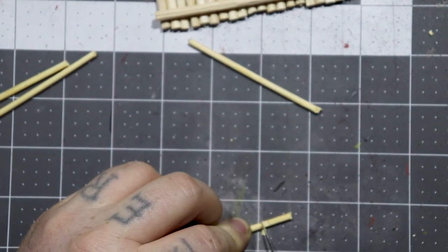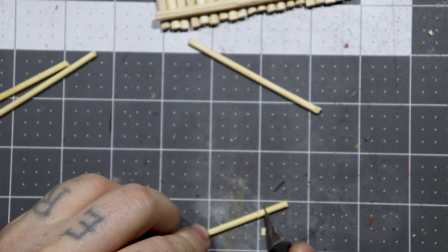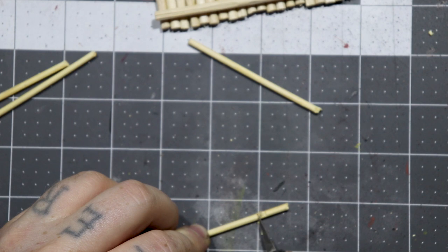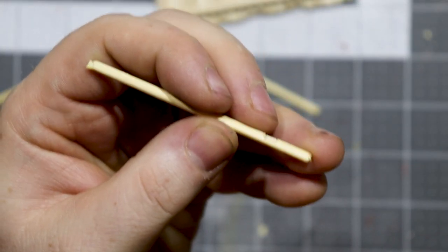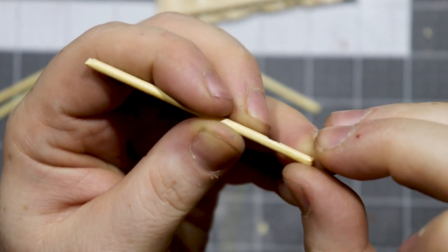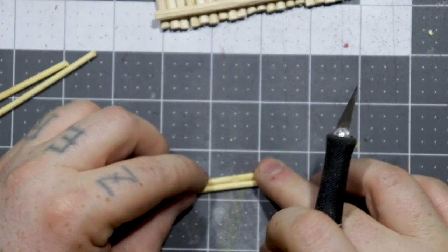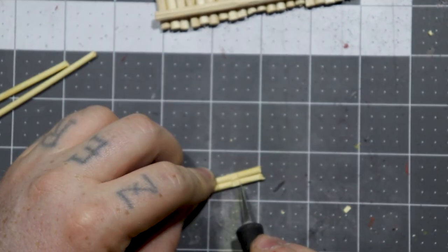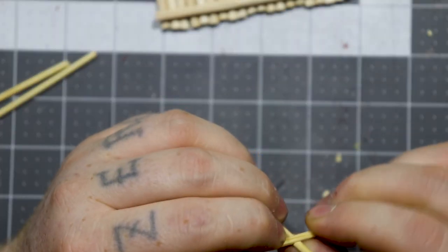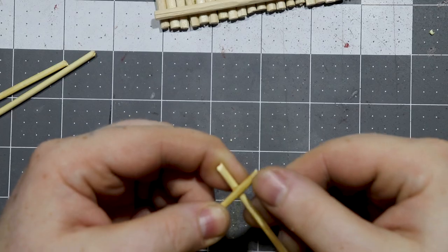And what happens is since you're putting a slot on either side, you pretty much prevent yourself from going over your line as long as you don't push too hard, and you can create pretty much a perfect notch in your little piece of wood that will fit a matching notch on the other side. So we're gonna do the same thing, only now it'll be easier. Now, when they're glued together, they look like they're meant to be that way.